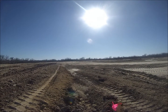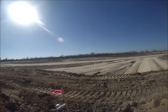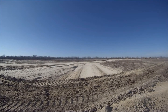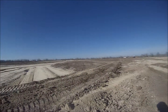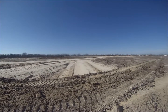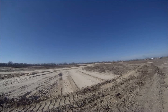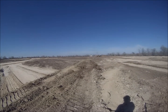Getting our fill placed on the pipe yard job. I've got my stakes laid out and what we're doing right now is we've got 1% of fall from the middle of the pad going this way and 1% going the other way, so we'll have a high point. This is a 20-acre job and I believe our halfway point to the edge of the pad is 350 feet, so at 1% that's one foot of drop per hundred feet.